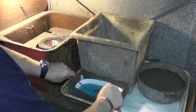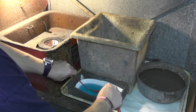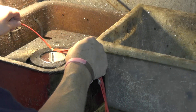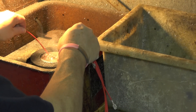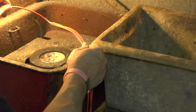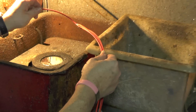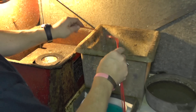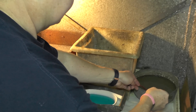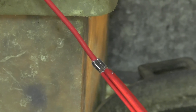Then that splice was taken to a dip-soldering station. There, the splice was first dipped into a cleaning solution to remove oils and oxidation which would otherwise hamper the solder from adhering to the splice. Next, the splice was dipped into molten solder, shaken to remove the extra solder, and cooled in a neutralizer. This was the splice method that manufacturers used for years. The negatives to dip-soldering are the possible introduction of acid and limited quality control.